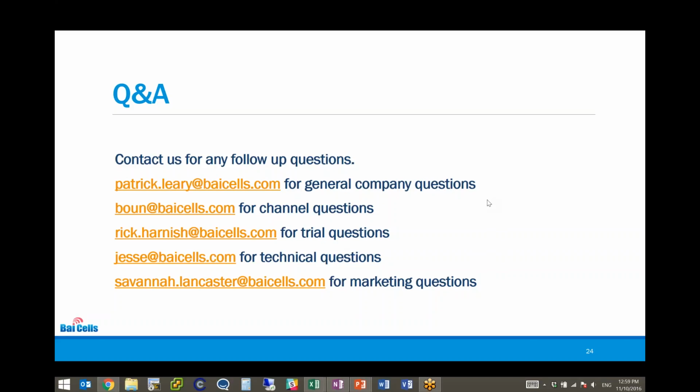Anytime new software comes out, we have the ability with the admin account to just do it remotely. Usually we'll send some posts saying at this time we're going to be updating stuff. We'll probably stop that procedure once the large update comes out, which we're calling TR6 internally, or B090. Once that software is updated, that's what internally they deem commercial ready, and at that point we'll unlock the OMC option so that you can also upgrade. We'll also probably add to our website, they're kind of larger downloads, but we'll have a manual option too, which you could, from the web GUI, upgrade the eNodeB software as well.